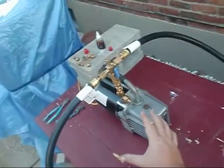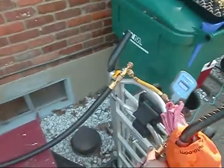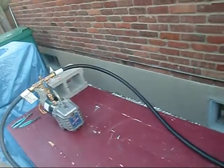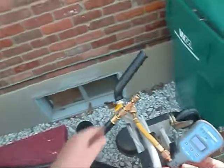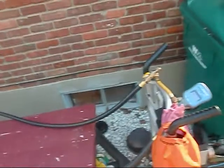We've got everything isolated. We're actually taking our Schrader valves out of our high side of our unit - going to have these mounted to that. We're going to take the Schrader valves out of our low side, and that's where I'm going to run my digital micron gauge. All we're going to do is open it up, open the vacuum up, and have at it - she should draw that vacuum down super quick now. And then I'll be able to blank it off. Once I can afford it, I'm going to get the real good hose for this micron gauge also. I might have to have it immediately the more I keep thinking about it.